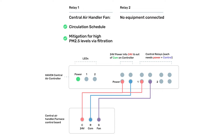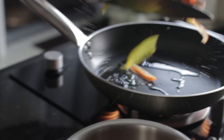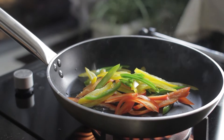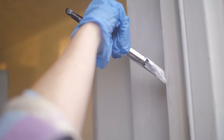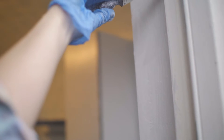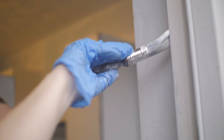When you commission the device to Wi-Fi in the app, the relay will be able to respond to high PM2.5 or total VOC levels. If your customer is concerned with particles and dust in the air, it would be beneficial to choose PM2.5 to keep the air handler running longer and force more air through the filter. Alternatively, you can have it triggered based on high levels of TVOCs — think nasty garbage smells, chemicals from hobbies, and even higher occupancy where you'd want the air to circulate to dilute the buildup.